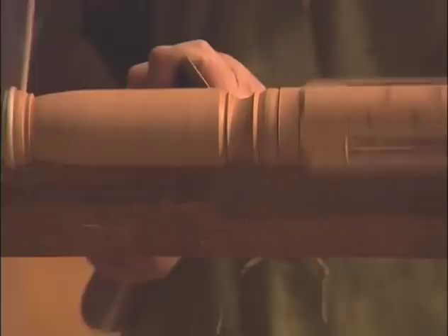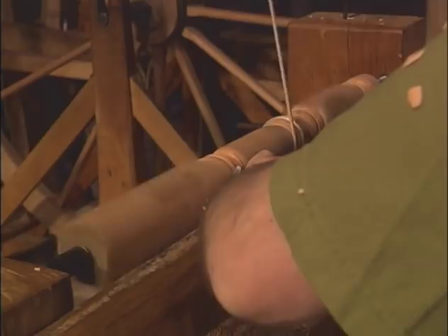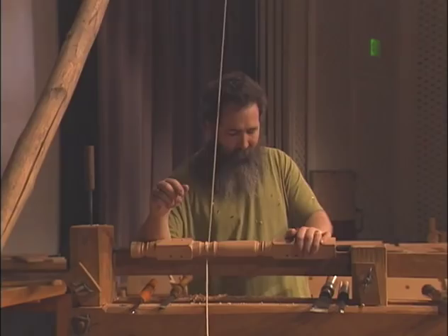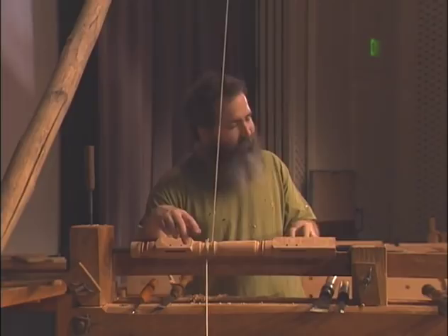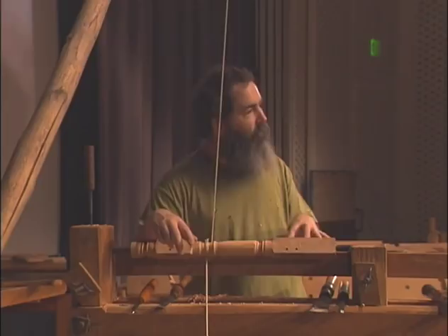You brought me some shavings — aren't you a good boy? The trouble with this clean museum is they came and tidied everything up during lunchtime. You've got to have shavings. Also, a good function for shavings in your shop: if you share space with a potter like I do — potters are cold in the winter because they're sitting with their hands in a bucket of water — they keep complaining about the cold and turn up the heat. Heat is the enemy of green woodworking because it can crack thicker stuff if the room gets too dry too fast. So I always keep a big pile of shavings and bury any real green stuff in the wintertime to slow down the drying and lessen the chance that it will crack.